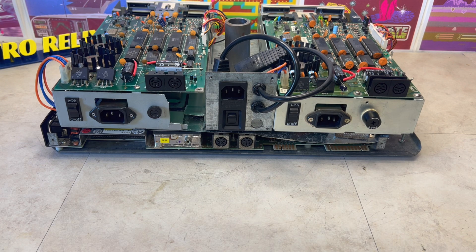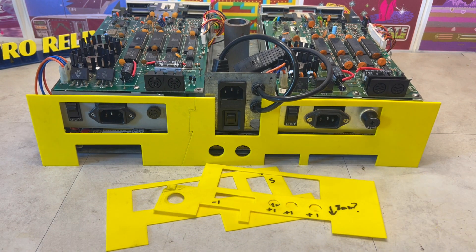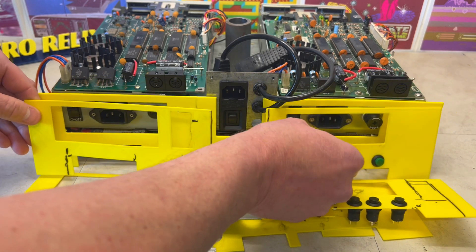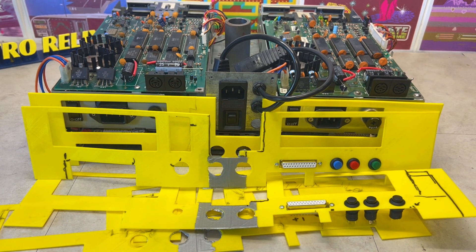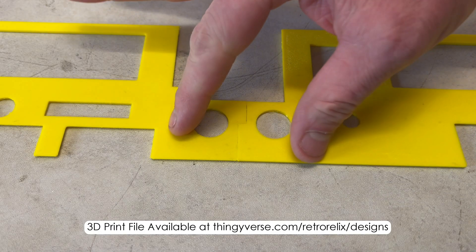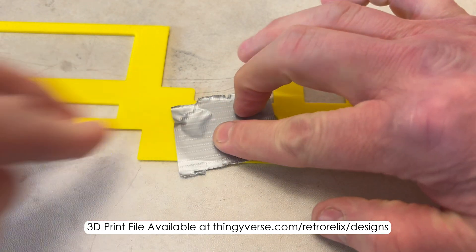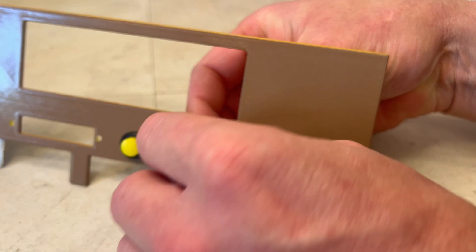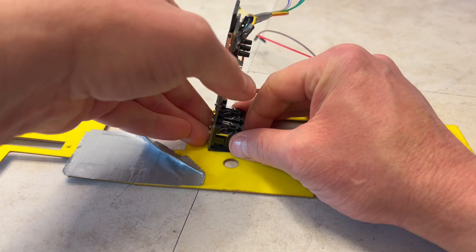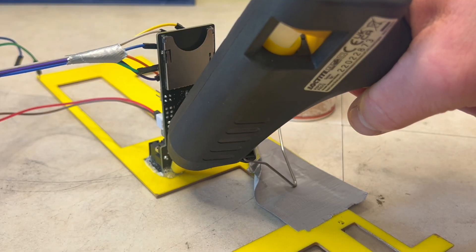As our requirements for the rear panel have now changed, I designed and 3D printed multiple iterations of a new backing plate until eventually reaching the final design. As the 3D printer wasn't big enough, I had to incorporate it as two separate parts. Securing it temporarily with tape, I installed the SD to IEC buttons and the unit itself into the back of the rear panel and secured it using superglue followed by hot glue.